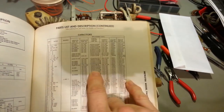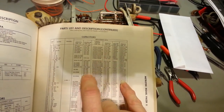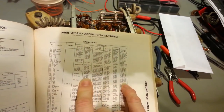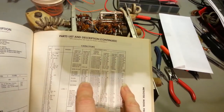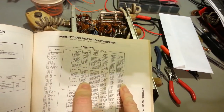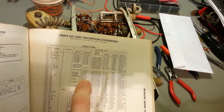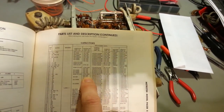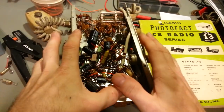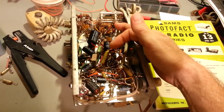And that's what I looked up, because I have a lot of old catalogs, and I have vintage 1960s Centralab and several different 1960s Sprague catalogs, and I looked up those part numbers, and yeah, they were just normal ceramic capacitors. The DD-102 is just a standard 1 kilovolt ceramic capacitor. Nothing very special about it. I think it's like a 10 or might even be 20% cap. But yeah, I guess when this exact radio was made, they got a bargain or whatever, for whatever reason they used these, and I've never seen those.